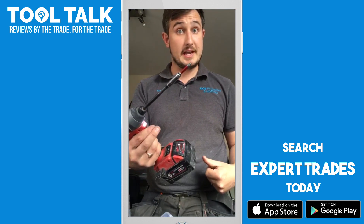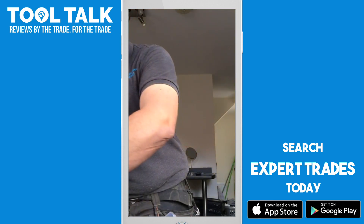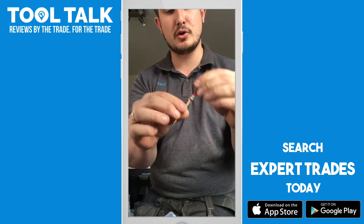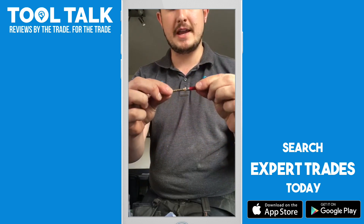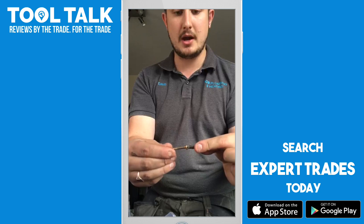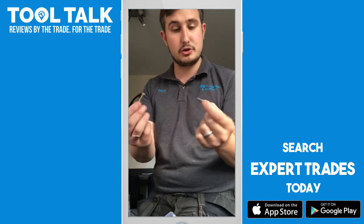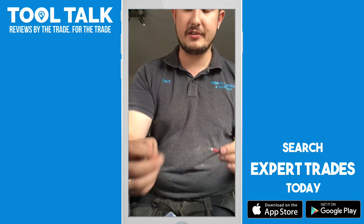I suppose it's not a problem if you need extra length — everybody likes a good bit of length! But with these, what I'd like to show you is there is so much less movement in the actual screw. This is just a typical 2.5 inch 10 screw, and you get a lot less movement once the bit is seated. With the other ones you get quite a bit of movement — that's not a particularly old bit, I believe these are Dewalt or something I picked up from Screwfix. These ones have a much tighter fit.